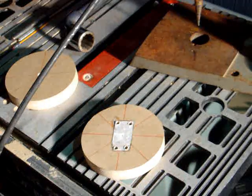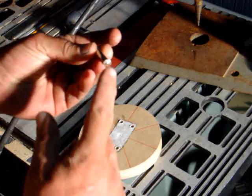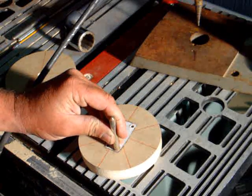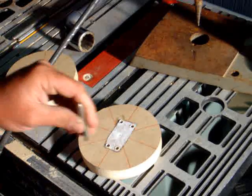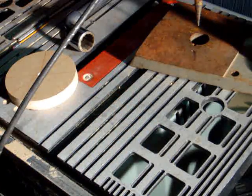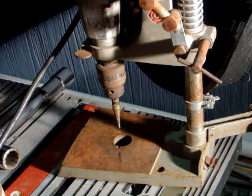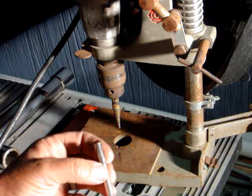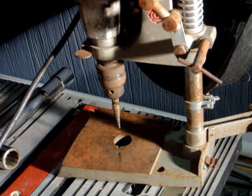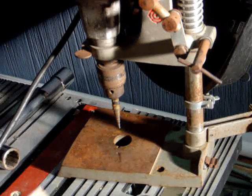So I got this part done. In order to get these set where they're supposed to, I took one of these that I ground and had a nice little point dead center — that's the size of what's going through everything. I put it right where it touched the lines on all of them and I beat the fire out of that. So now that put that point there, that put that point there and there. Then I went ahead and used this countersink right here into the drill to get this hole started, and I'm going to put the other bit that I made, which is right here, and I'm going to drill these holes. When I do that, I'm going to take them right into the next piece — and that means this is not good, but that's alright. I plane back to here and I don't care about that little hole.